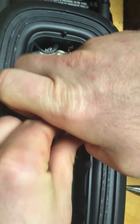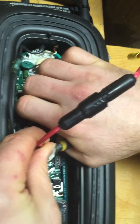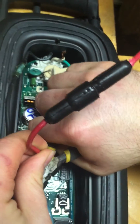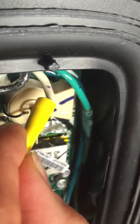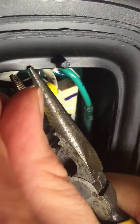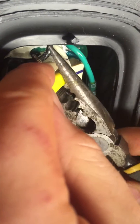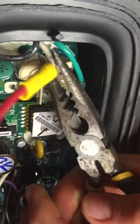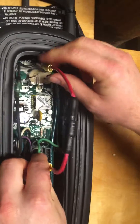I'm going to put my butt splice connector right onto the neutral line and take my needle-nose pliers to crimp that right down on there. I'll take the other side and connect that right there. It gets kind of tight in here. My inline fuse is now connected.